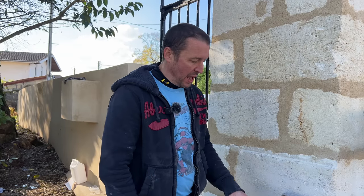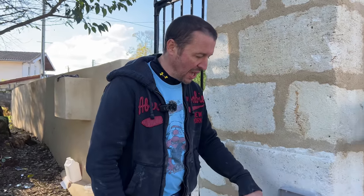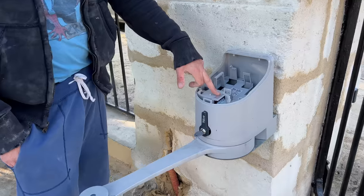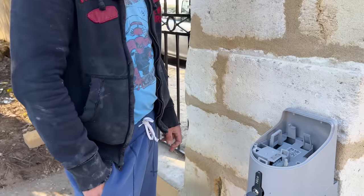So I was just trying to commission, to program the unit on the other side, and I just kept coming up against it not programming properly. Then I went over the instructions again, still no wiring that was missing, and then I noticed that there were two wires missing for encoding that have to go back to the box. There was no talk of it in any of the instructions. There was just an encoding port. And I just so happened to notice that the motor that's connected in the box there has the encoding wires. So I've just figured out I have to pull 5 wires through, and I only have 3. So it's like one step forward, two steps back.